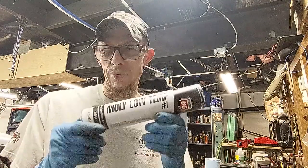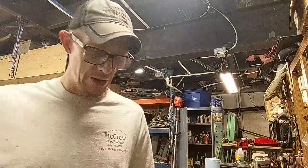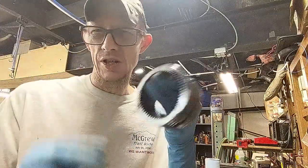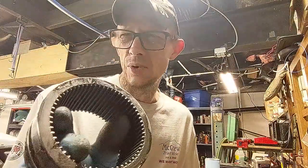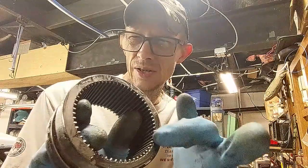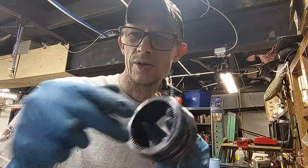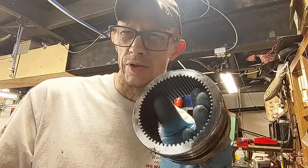I have all the bits to put the winch back together now. Just got to touch on a couple things as far as lubrication and the assembly process. You don't want to get crazy with the grease and lube on this because it will just gum things up in there. We have the super special lube. Basically what we're going to talk about is the gear housing, how this gets lubed up, and your free spool clutch. The free spool clutch has two sides. This is the end that will go down and engage with the case - you can see these are like cutaway with a little gear cog, so it makes it easier for this to ratchet into the housing. Whereas this side is more of a machine surface - it makes it a little bit more difficult to get down in there. We can just slam this guy down in here. No real reason to lube up the housing - we don't want to gum it up.